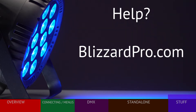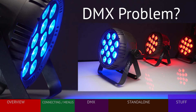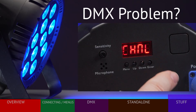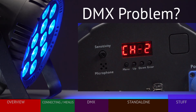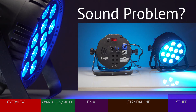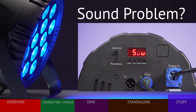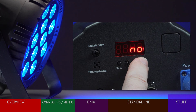If your fixture is not responding properly, refer to the manual or contact the manufacturer for troubleshooting help. Make sure your fixture is set to the correct DMX address. If one fixture is showing the wrong color, check the channel setting to make sure it is set to either 1 or 2. If DMX signal is coming in, the indicator light will be on. If sound mode is not working, make sure the fixture is set to sound, try adjusting the sensitivity knob, or move it closer to a speaker. And remember, if you're not sure who was using it last, just hit reset and start over.